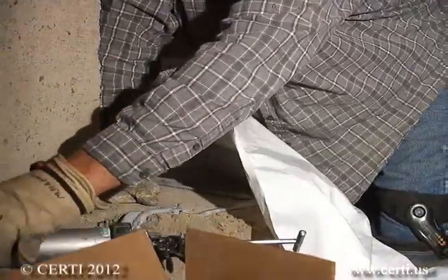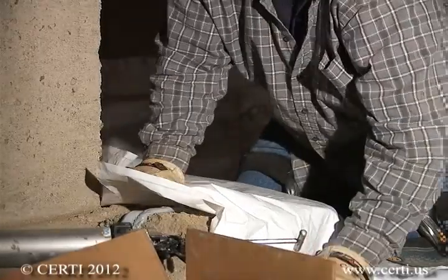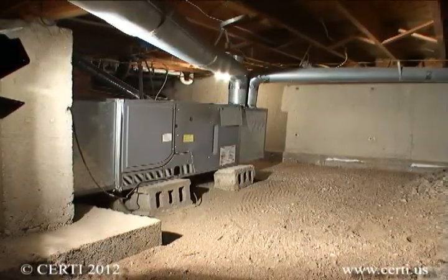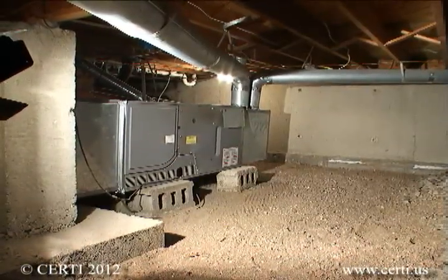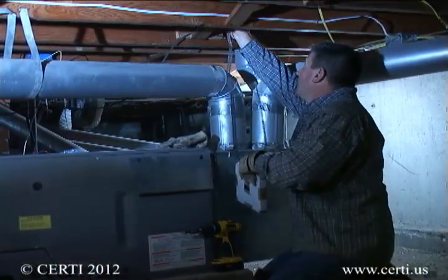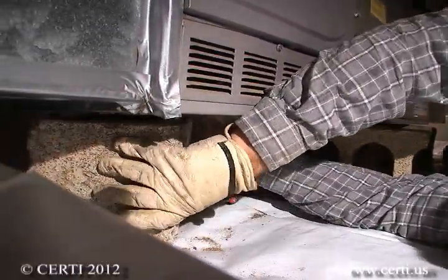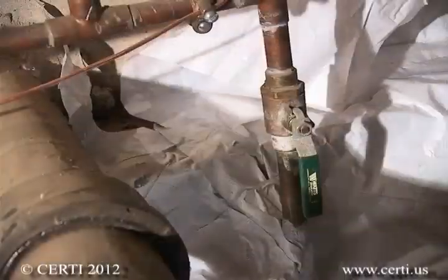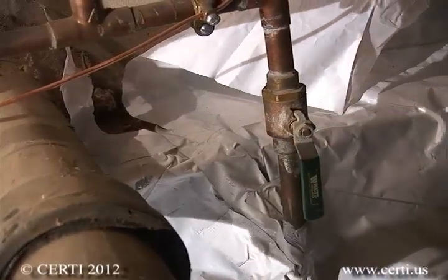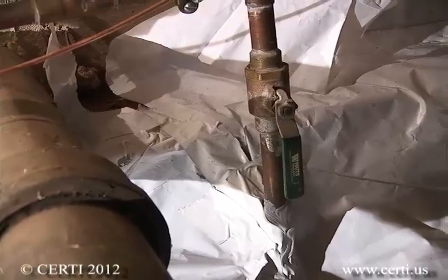Cut your plastic sheeting or use scraps of plastic to seal the barrier to pads and support posts. If there are appliances such as furnaces in the crawl space, you can seal the plastic to the pad beneath it, or if there is no pad you can temporarily suspend the appliance with metal strapping, remove the blocks, slide the poly beneath the appliance, and then replace the support blocks. Be sure to also seal around pipes that come up from the soil such as water or sewer lines, being sure to allow for access to any clean outs.